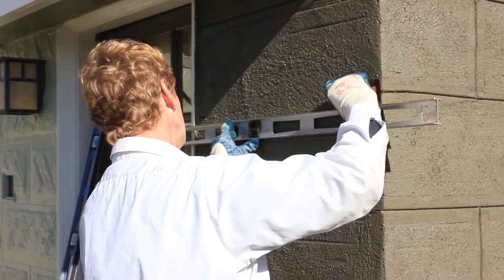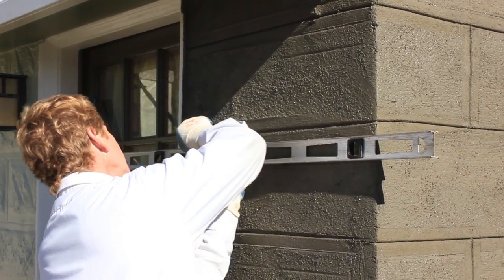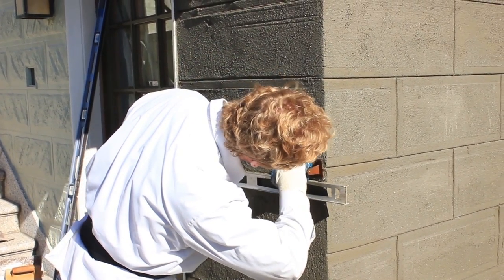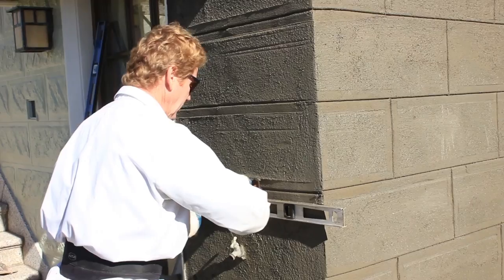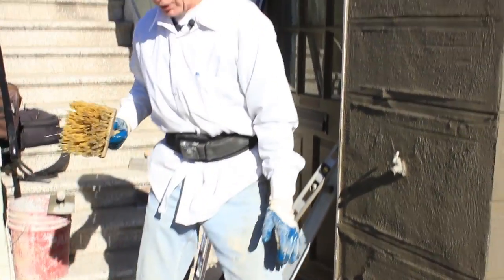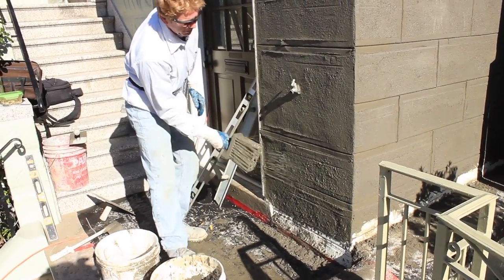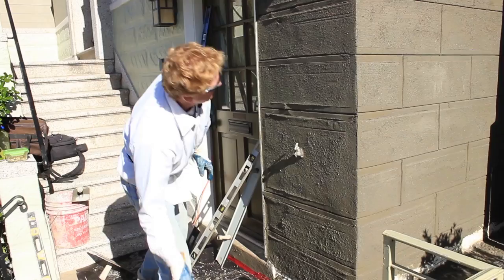Get this level - oh, that looks level. Then I'll put my expansion joints in. This is just one more step - we still got to dash this whole thing. You might say, what the heck is a dash? I'll show you as soon as I line this last one up. You want to line these holes up and scrape them. It doesn't matter what it looks like right now - it can be ugly because we still got to dash it. Dashing means we take this brush, dip it in soupy mud. You say, wow, you're gonna mess up your pretty work - that's okay.